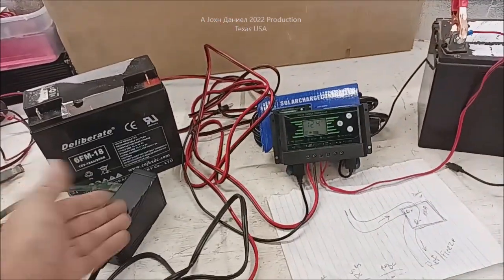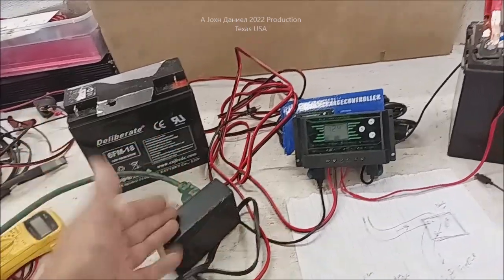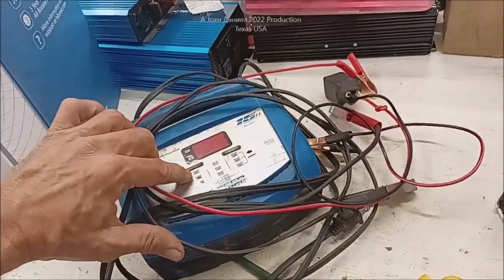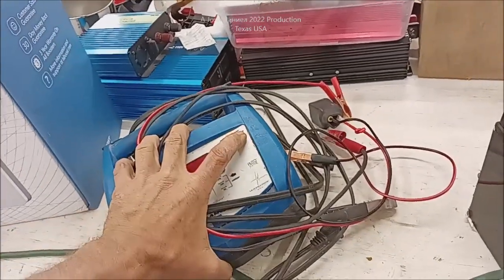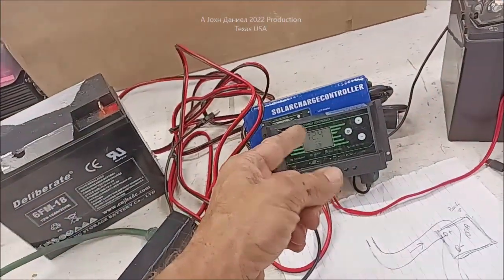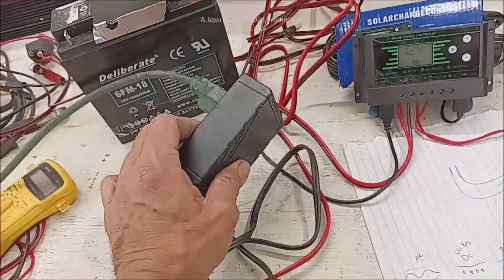Look at Goodwill, garage sales, and eBay for wall wart power supplies — I'll put a link below the video. Now, you might think: I've got one of these battery chargers. Don't worry — I know it pulls 365 watts. If you put it on maintenance charge, that's only one amp, but if you put it on fast charge, when it hits 100% it'll boil that battery. And when it reaches 100%, it just shuts off — you've got to come back out and press buttons to make it kick on again. So don't run a battery charger through this charge controller; that battery charger is not acting as a regulated power supply like that wall wart does.